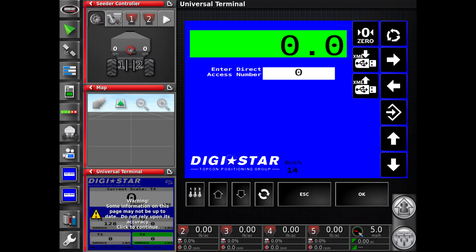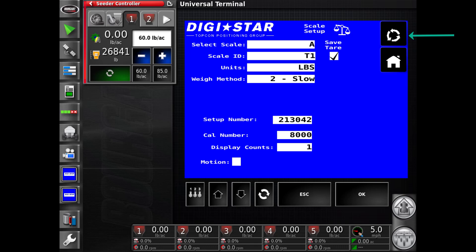Touching the cycle button again will take you to a screen showing a number of settings for the selected tank — in this case, tank 1. These are all factory default settings based on the model selected in the profile. It shows the setup number and calibration number here. These numbers should not be changed in this screen, as it will not update the X35, only the SL2. Only change these in the settings screen for the scales, as shown earlier in the presentation.